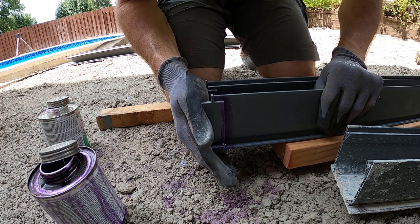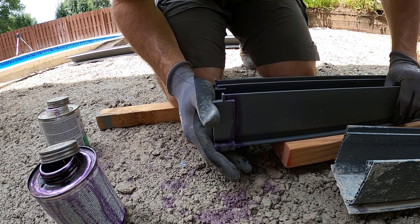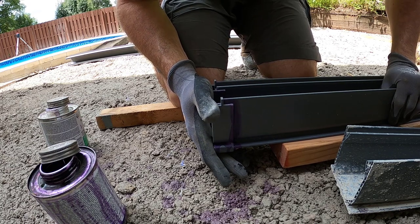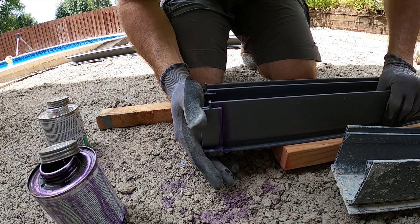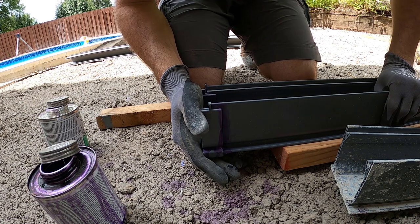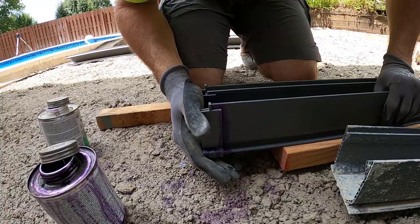My plan is to put couplers on one side of a bunch of sections, get them laid out in a line, then start connecting them. I don't know our exact run — it's about 45 or 50 feet, so a pretty good run. Then I'll come back once I get them all laid out and show you my plan to stabilize and hold the channels in place since I'm not pouring cement on either side. I think I'll use edge restraints and ground stakes, then bring in additional compacted limestone on both sides.